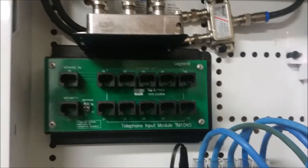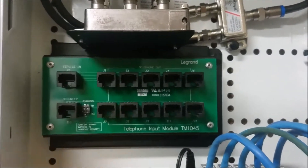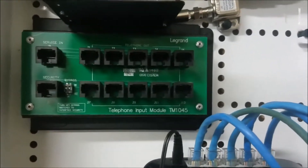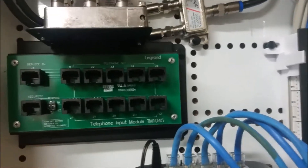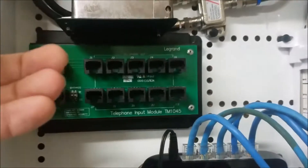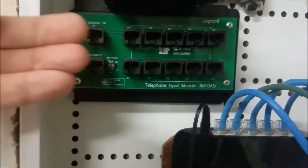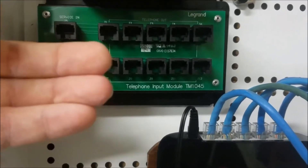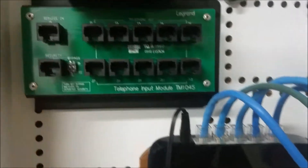Going through the actual interior of this cabinet, I went ahead and purchased this off of eBay. It's a LeGrand phone distribution panel, and we got the pushpins over here that came with it. The problem is this device was not made for this kind of cabinet, and I found that out after it was shipped to me, because this side actually has sort of little hooks. In order to make this work, I had to take a Dremel tool and shave off the edges so I had just a little bit of hook so I could put it in that hole and make it work.